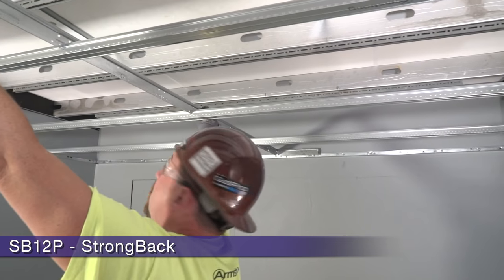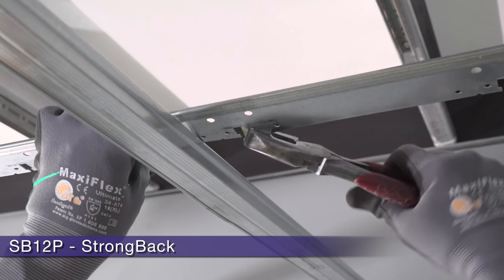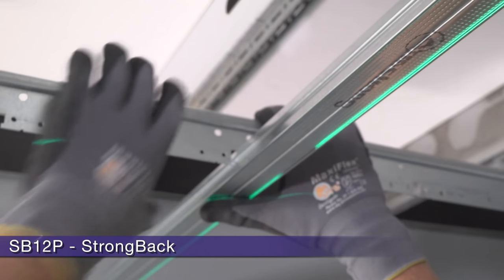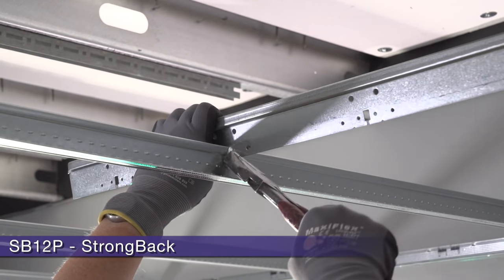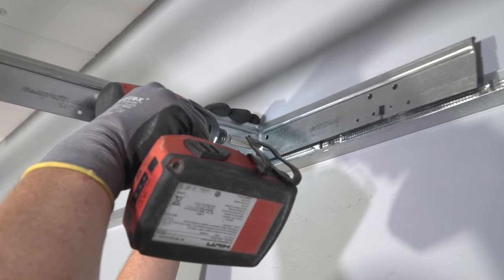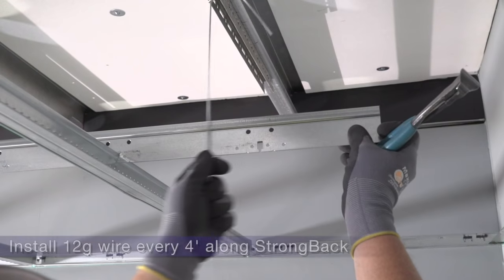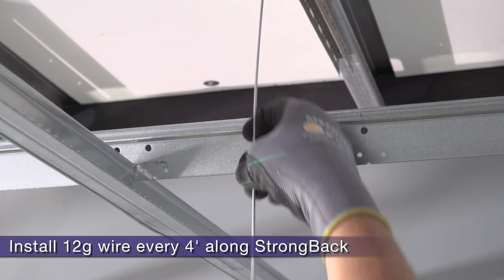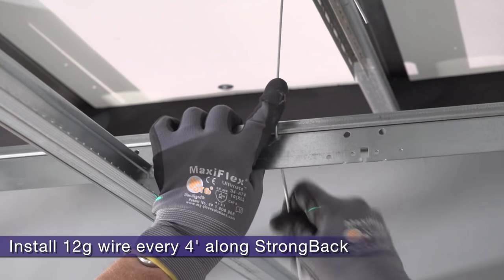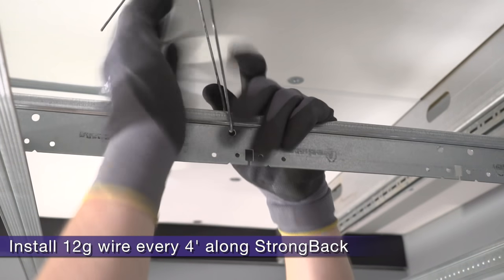Only one installer is needed to install Short Span. You can also open the notch on the strong back to engage the Short Span bulb, provided you close the notch around the bulb with your pliers. Previously I bent the strong back 90 degrees into what I call a hockey stick. By anchoring the hockey stick to a wall stud, your first wire can be four feet from the wall — three feet in seismic D, E, and F areas. If you don't install a hockey stick, your first wire will need to be at the first Short Span tee.